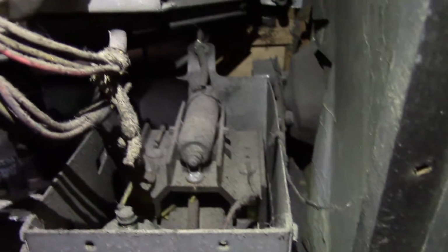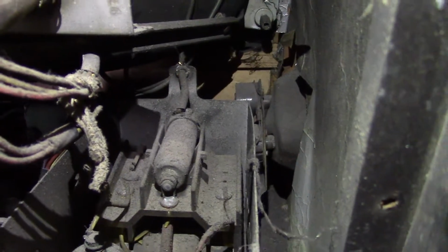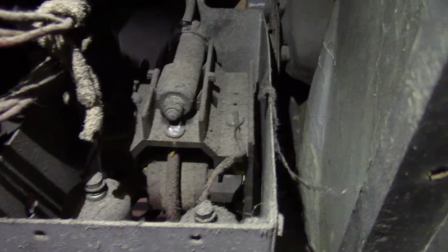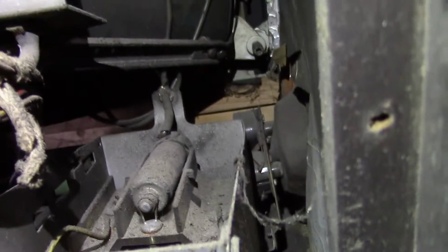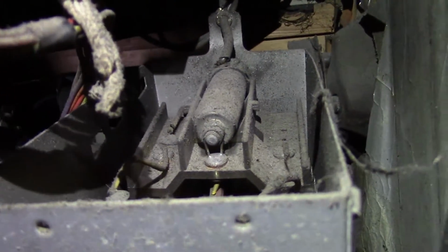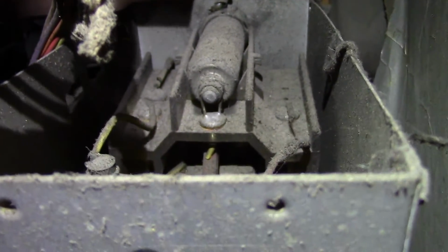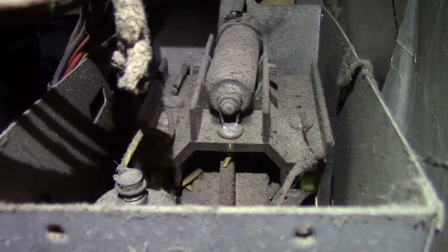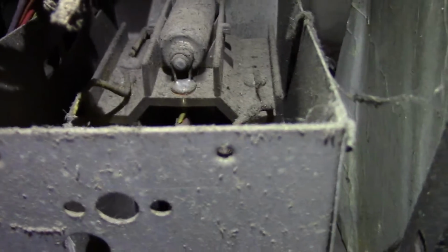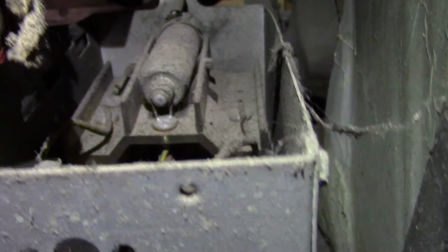Now, I've already read a bit about this high voltage box, so I knew it's a little bit different than what we are used to here. I think there are two horizontal output tubes. I don't know if they're push-pull or in parallel, but that's what I believe those two tubes are there. And the thing up top, I think that is the high voltage rectifier tube. And yeah, I'd read that they use Perspex plastic for the mounting up top there, which is that stuff you see kind of in the middle of the screen. And often they're really warped and twisted and deteriorated and horrible looking. This looks to be in really good shape.